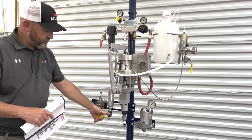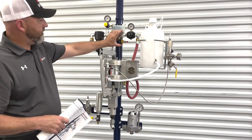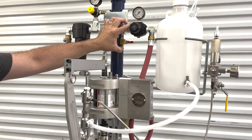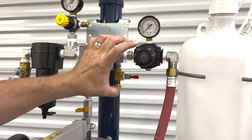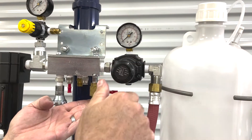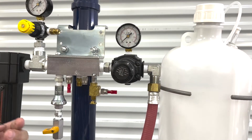And when we do that, we're going to close this back off. Then we're going to prime this up to 40 pounds. We don't want to exceed 60. So we'll push the button and then we'll prime this up really slow to 40, not exceeding 60.